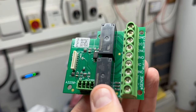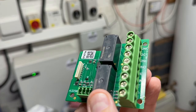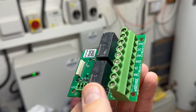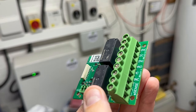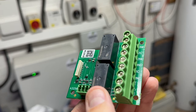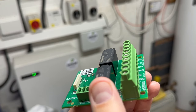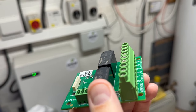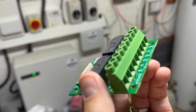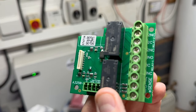I've had questions about why I can't just use the MyEnergy API to turn the Eddy on or off. I'm a fan of local control — I don't want to involve the MyEnergy API if I can avoid it, that's just a personal preference. I like all my smart home control to be as local as possible. I'm also not convinced about the reliability of that API, because I currently have it connected to Home Assistant and it does connect and disconnect on a fairly frequent basis. So I think it'll be easier to use the relay board — it's more of a hardware solution than a software solution.